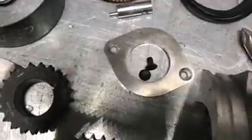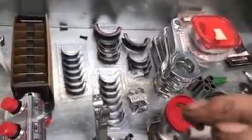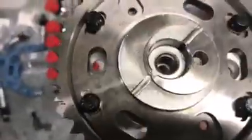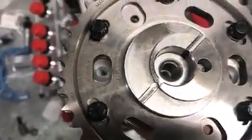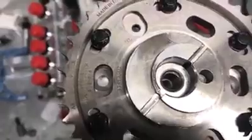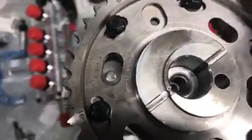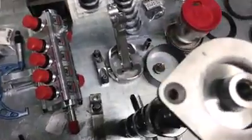We are now making and supplying our own thrust plates. When you assemble your camshaft, you can see the thrust plate has bolt holes that actually align with the timing gear. If you want to remove your thrust plate or camshaft, you can now remove it as an assembly from the engine rather than having to use pullers when the chain has tension on it. You can pull everything apart just like our belt drives — all in one unit with the cam, thrust plate, and timing gear.